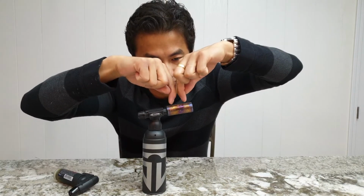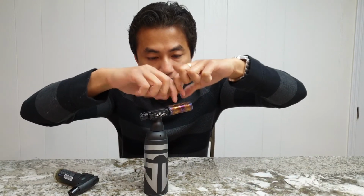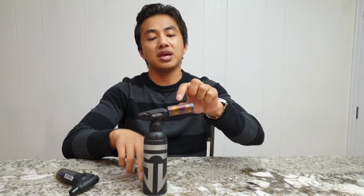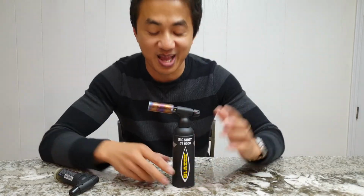The section right here, which we never heated, will be gold because it was in a section that we heated in the beginning, so it will be the first color. So it's the intermediate transition portion that gets purple because we never heat it. It just receives heat from the midsection pulling outward and from the outer rim pulling inward. And then you get the gold that turns into the purple with the heat on the outside going in, and then you get extra heat from the rim turning into blue. Whew. Okay, that's that. I don't know if I can say that again, but that's that.